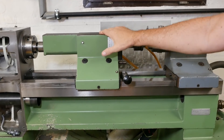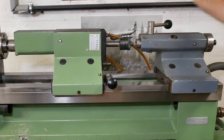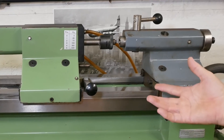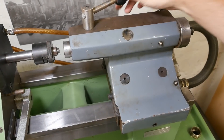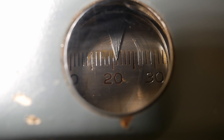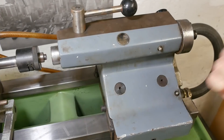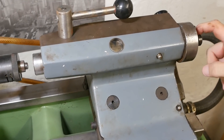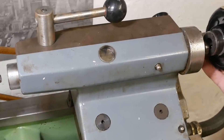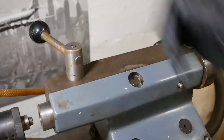As all long-term viewers know, the trend is to a second tailstock — this is the manual one. The way I use my machines, not really in production, not doing that many parts, I figured this may be more useful than the CNC one in my workshop. For a Schaublin component it was incredibly cheap — too cheap to pass up. But it moved smoothly so the main meat of the thing looks like the bones are in pretty good condition. At 200 bucks, it's missing its original handle but this one was put in — I'll be able to modify that to fit, I'd say, or make something else. This lever doesn't seem original to me — it's a bit wiggly, I'll have to have a look at that. Looking up underneath, that locking mechanism is definitely not original.